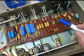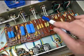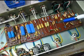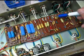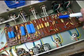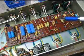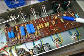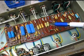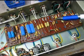This is one notable difference. Since this amp is a 69, the channel splitter resistors are 470K, giving you a little more separation, less interactivity on the volume controls. Because this is a PA amplifier, there is no typical bright cap, which was the big modification that Marshall made to the early Fender circuit. There is no bright cap here over the bright channel, and in fact there is no bright capacitor on the volume control. So the frequency response of the amp is extremely flat in terms of any kind of treble boost. Even though this amp is a 69, it bears a lot more resemblance to an early Plexi than other typical 69 amps. It's a very strange amp.